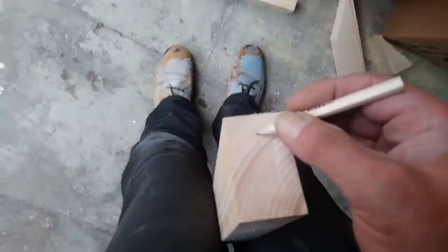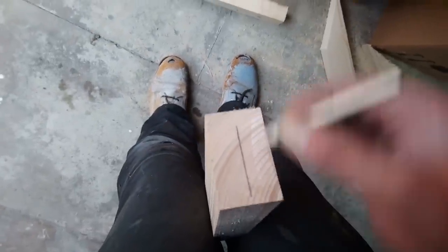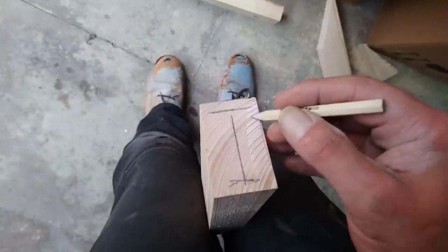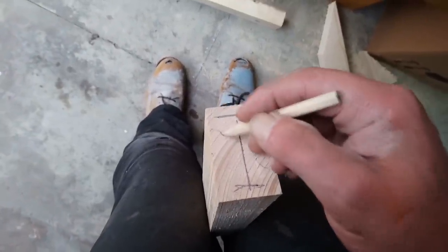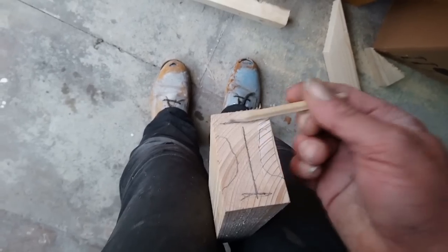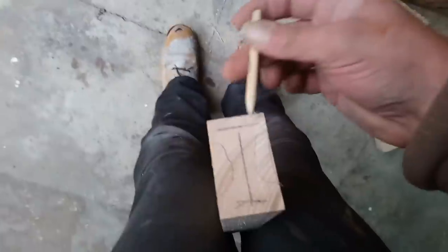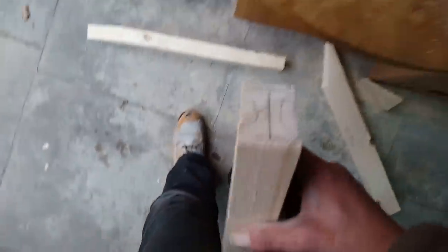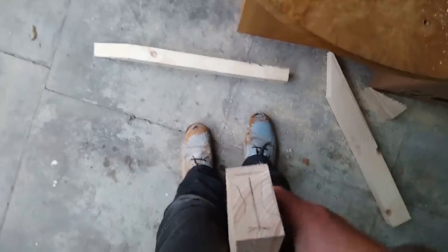Timber works a little bit like an I-beam. That part you don't really want to be chopping into. These pieces on either side are safe, that's why you should always drill your pipes through the middle, not top or bottom. So drilling straight down through that bit, it's okay because I've left these two side pieces.